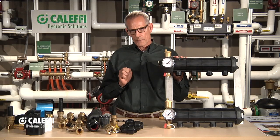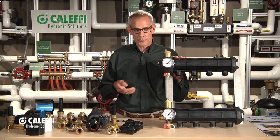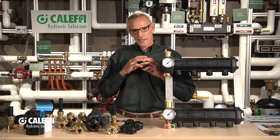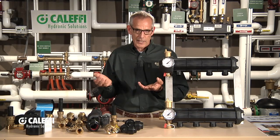I want to explain first why you would want a geomanifold. Traditionally, when a geo-loop field — like a ground source loop field or a pond source loop field — is put in, a manifold is put out in the yard somewhere, the tubes are heat fused together, and then that manifold is buried and nobody ever knows where that is. If you have a problem with that loop field, you're out of luck because it's not an easy thing to find and dig up.